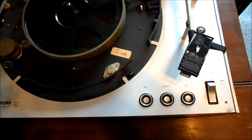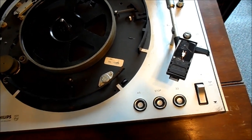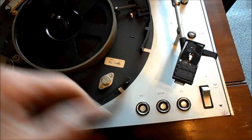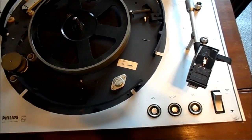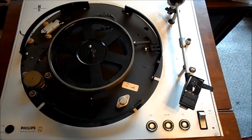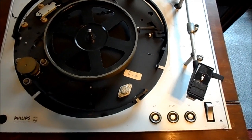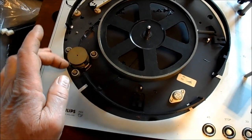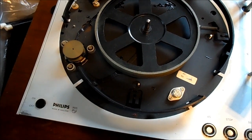What mine does is it starts off slow — a few percent slow when you start the player. Then within a minute's time it comes right up to speed and stays locked on speed. I want to use this one to see if it has the same issue. There's a germanium transistor in here, and the boards inside have all those European-style capacitors and transistors. The stripes on the capacitors mean I'll have to look at an international European standard to figure out the values. There's something wrong with the circuitry in my turntable. It works fine, but I don't like that it takes a minute to get up to speed. It does have about five leads coming out of the motor, so it has some kind of tachometer or servo synchro built in that the electronic circuitry monitors.